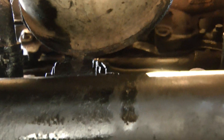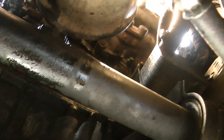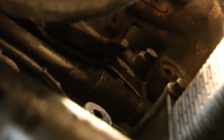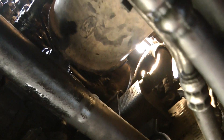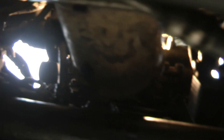We spent some time this morning stripping out the top of the engine, hoping to remove the inlet manifold from the top so it would expose and make our work on the exhaust manifold much easier. However, it transpired that there are some bolts in there — in particular that one up in there you can't get to from the top. So the work we did trying to remove the inlet manifold and the EGR and all that from the top of the motor was a waste of time. We're going to have to do it from underneath, which we have — we got all the bolts out from underneath. When we tightened it up six weeks ago, it cured the problem.